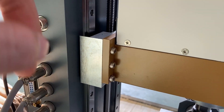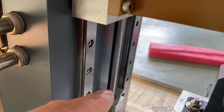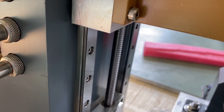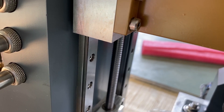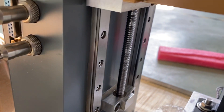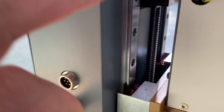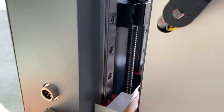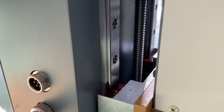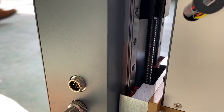The Z-axis uses a ball screw. The diameter — we can find that from the spec — and the pitch should be about 2mm pitch, but 4mm lead. There are two MGN linear rails, one on each side.